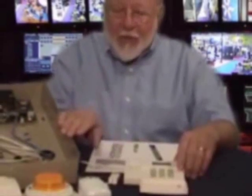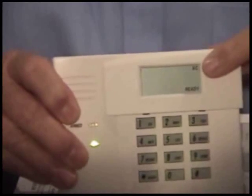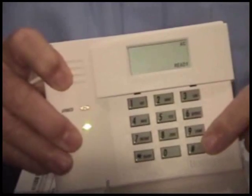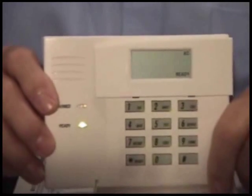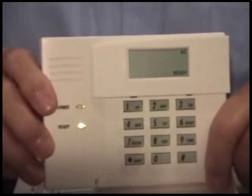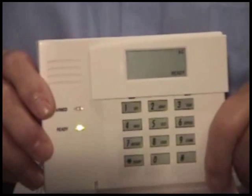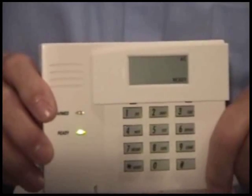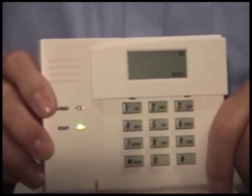Let's talk about entering program mode. Our system is booted up, all devices are connected, and the keypad display is ready. There are two ways to enter program mode. When we powered up the system, for 50 seconds it displayed D1 in the window. During that 50 seconds, you could push the star and the pound key at the same time and it would enter program mode. A tip: the system expects you, as the owner, to do things in a fluid, confident manner without hesitation - it has a very fast reset so a crook can't hunt and peck and figure out your code. Map out your strategy before you start pushing buttons, because once you're in program mode you can turn it into a door stop real quick.